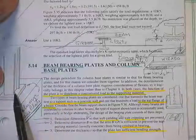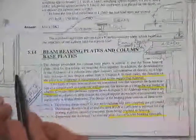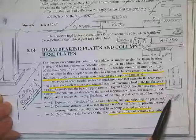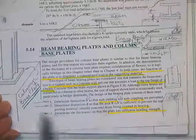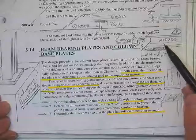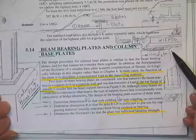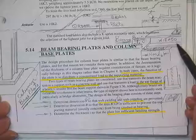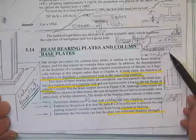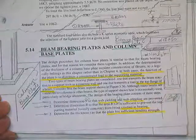The whole purpose is so that when you push on the concrete — which is weak — with high-strength steel, you don't just gouge a little H-shaped hole in the concrete. You put a steel plate between the two. This steel is quite strong; you can have such high loads that the concrete is only 3,000 to 5,000 PSI, where the steel is 60,000 PSI strength. You need a plate underneath to spread the load out so the concrete is happy.